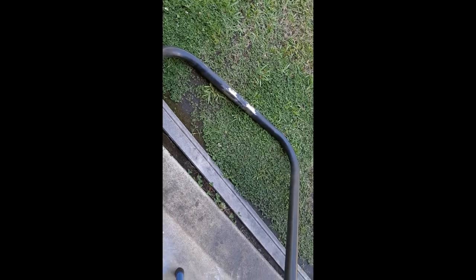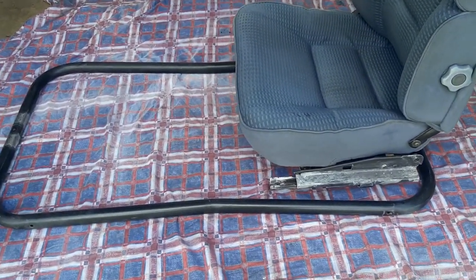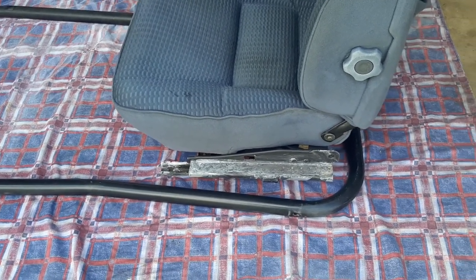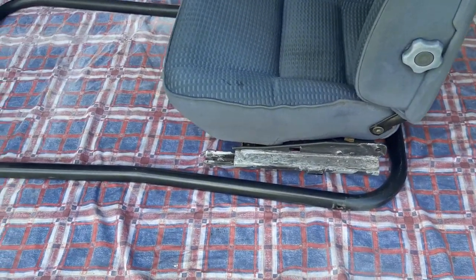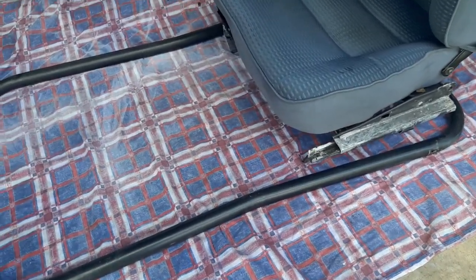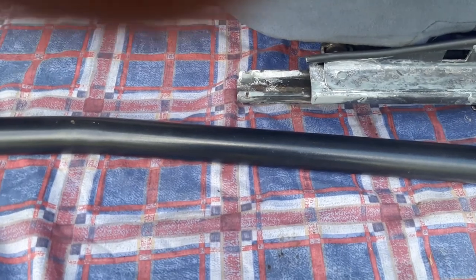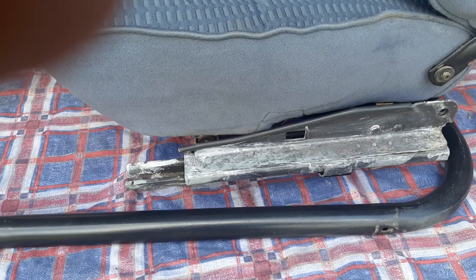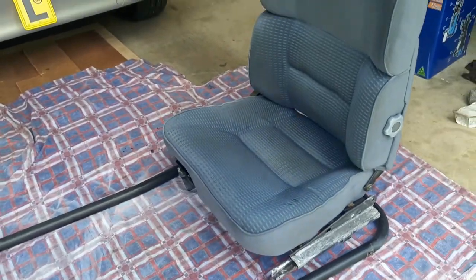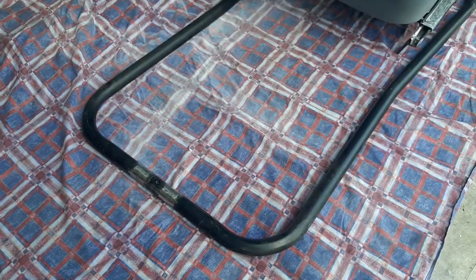Keep working it until it's as smooth as you want - it's going to get painted but at least it'll look neat. Next we're going to mount the seat on the frame. I've got the seat mocked up roughly where it's going to go, leaving the tracks in so you can adjust the seat. With it in the rearmost position there's a bit of overhang so it won't tip over when fully extended. I'll run two pieces of pipe across the frame and work out the pedal position and steering wheel support.